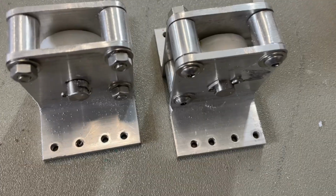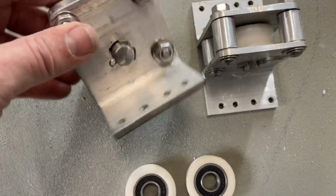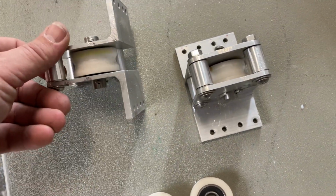As we continue forward, we plan to install a shaft log to pass the shaft through the hull from the motor to the propeller. We will have to build a custom motor mount and add a thrust bearing to take the load off the propeller. Next, we need to design and build a 3D printed rudder, which we will then wrap in fiberglass. We built a custom cable pulley to route steering cables to the transom.